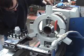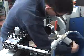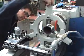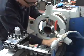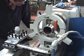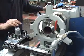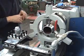I'm just going to gently approach the rollers, making sure they're clean, and just touch them lightly against the work piece. Once I've got that set up and locked into place, we have full support, and that allows us to do most machining operations without worry of it moving on us.